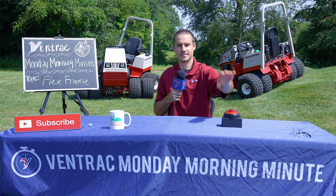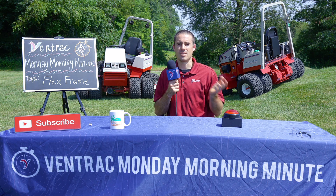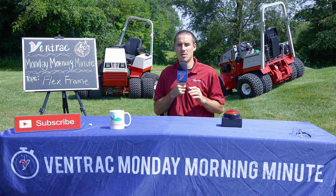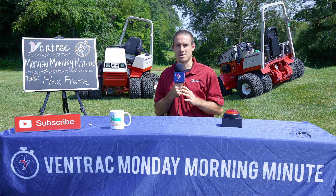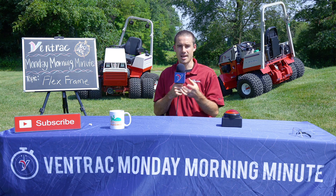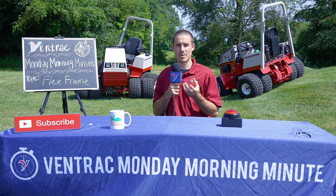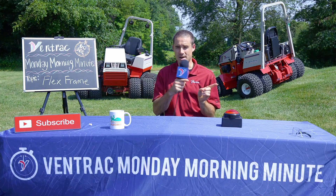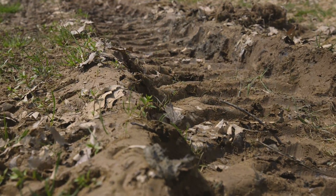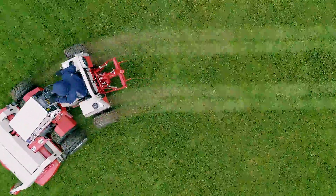You might be thinking, that sounds nice, but what's the advantage? How does it compare to what everybody else has? What most people are familiar with when you think compact tractor is a standard sit-on-the-back, steering wheel in front of you, rigid frame, single-piece tractor where the front wheels turn to steer it. When you turn those machines very sharp, those front wheels are jacking all the way to one direction and you're literally tearing the turf to make that turn. Being able to turn the Ventrac by having the front and rear axle follow the same wheel path does zero damage in comparison.